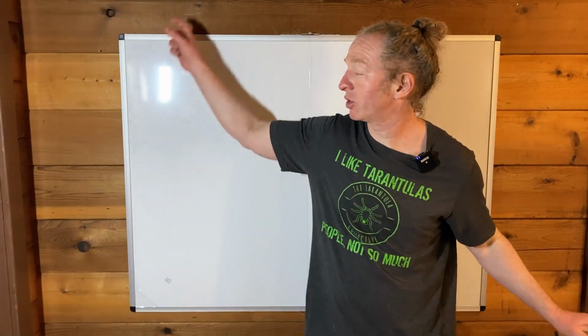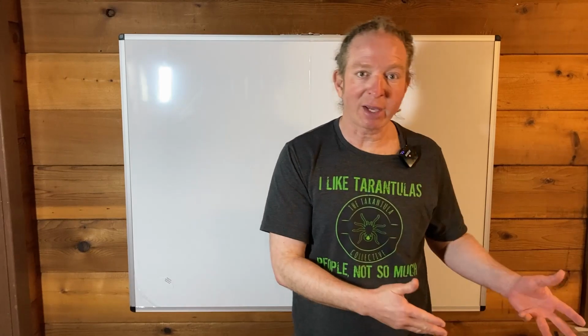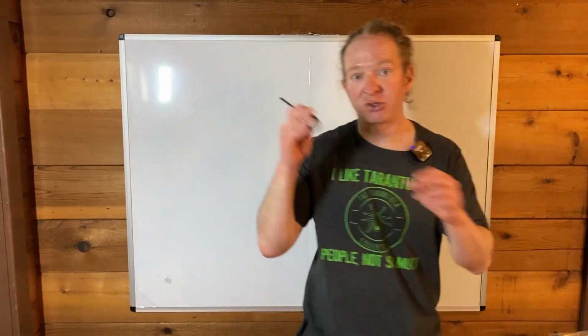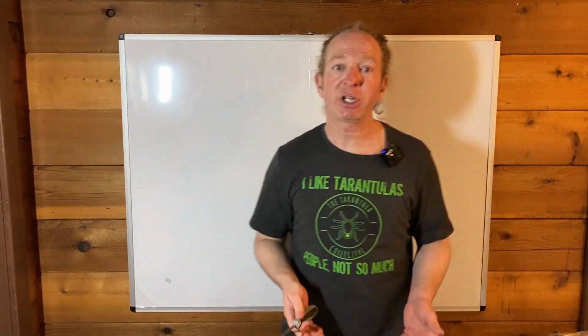These walls are solid cedar, so I did not use the drywall anchors. Also, my drill is bad, so honestly, I just used a screwdriver and I screwed into the wood. Not recommended because you can split the wood. Fortunately, I didn't split the wood. So you're supposed to drill pilot holes.